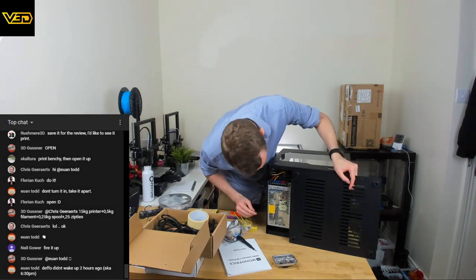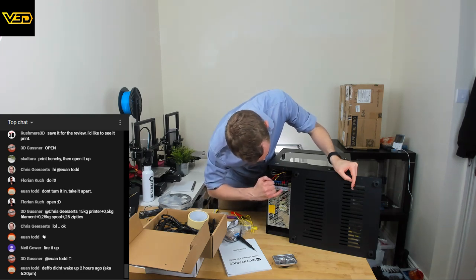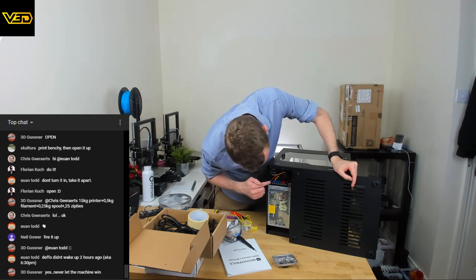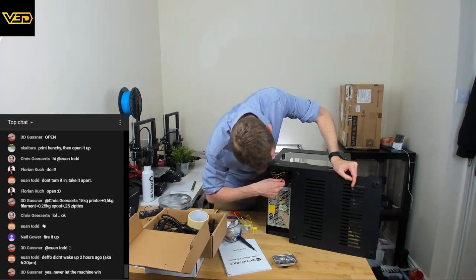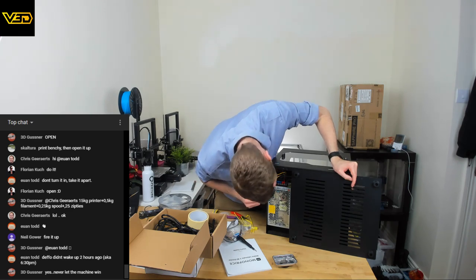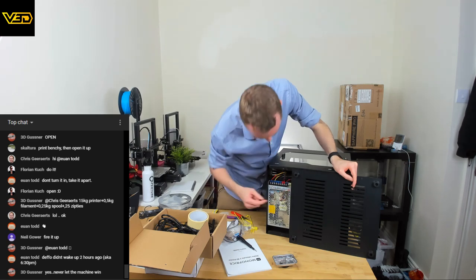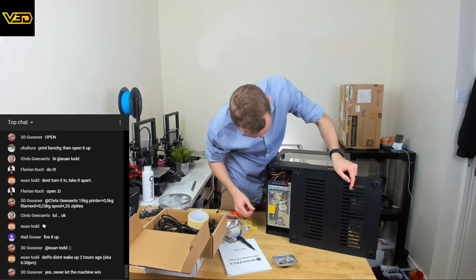Piece by piece. So, power supply, 24 volts, 200 watts, quite low wattage, so bed heat up. It's quite small, so it should be maybe all right. Wiring looks really properly well done. There's no dodgy connectors. Everything's properly in and reasonably tight, with proper covered connectors for the power connector. It is a Meanwell unit, so it's not some weird dodgy knockoff. It's proper clean power.